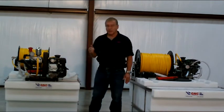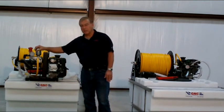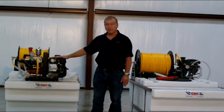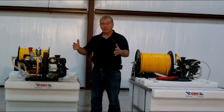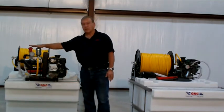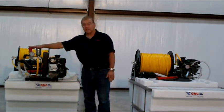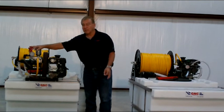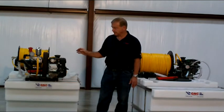The other thing you need to understand is, when someone tries to sell you a sprayer, take the gallons per minute of the unit and the pressure that the pump can spray, and use a simple formula that usually comes out on our website or you can find in any engineering handbook. And if you want it, call us on our 800 number, we'll help you. The engine needs to match up to the horsepower requirements of your pump. If you get too small an engine, it's like buying an 18-wheel truck and putting a 4-cylinder Chevrolet engine in it. It might pull it one day, but it won't pull it very long. Make sure they're matched. That's very critical when you buy something.